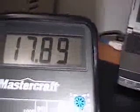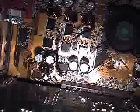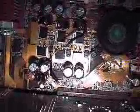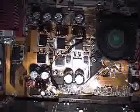Let's look at the soldering job I did inside the computer. What I did was solder two pieces of wire on either end of the resistor, which gave it the length needed to connect to the motherboard. I used regular solder and a regular soldering iron. I can't stress enough — this is a very, very delicate operation. You certainly have to take your time, be very patient, and be very careful.